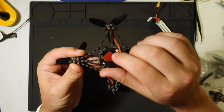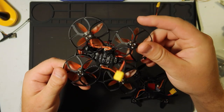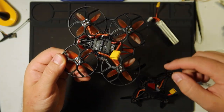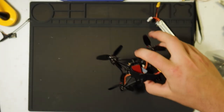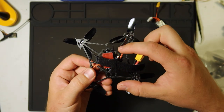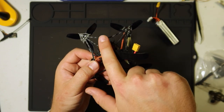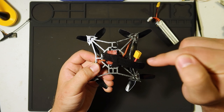I wonder if it's because of the carbon fiber. I have a video coming out about the Cinecan, which has no carbon fiber — same flight controller, same receiver, much better FrSky transmission. But with this one, maybe it is the carbon fiber surrounding part of the antenna, and the battery snuggling right up against it, that means you're going to have fail-safes really close.